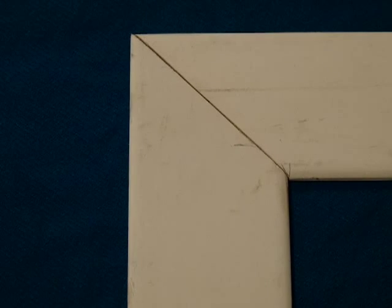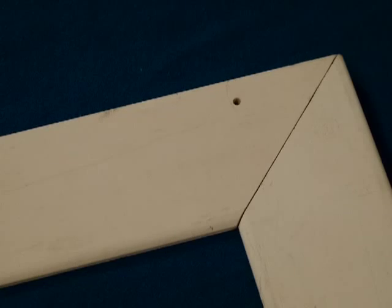Same on this corner — we have the same problem, it tapers from heel to toe, zero to two millimeters. On the other frame, which was produced after the adjustment, you can see that the miter in its entire run is nicely touching from heel to toe, with no unsightly gaps, and the same for all four corners.